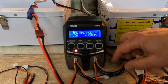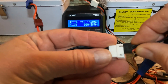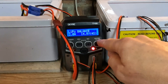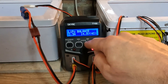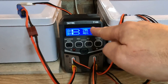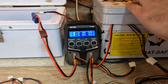Now for the 3S. The balance plug has lugs and gaps, but they don't match because this is the 4S plug, so the 3S goes in on that side. I just need the adapter. Switching to the other channel — LiPo battery — it's set to 2 amps, 4S, so I'll change it to 4.5 amps, 3S. Hold the button down, battery check, confirm. With two batteries going, the display shows both batteries and what percentage full they are — we're doing balance charges on both. Let's close up the fireproof boxes and leave them to charge.